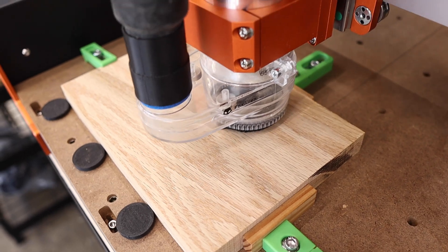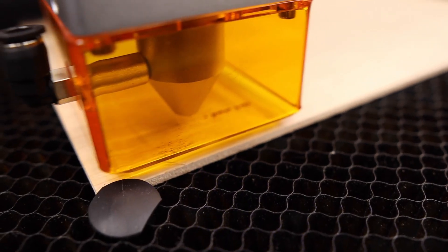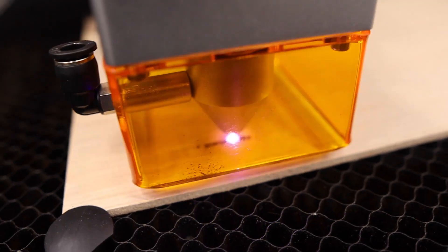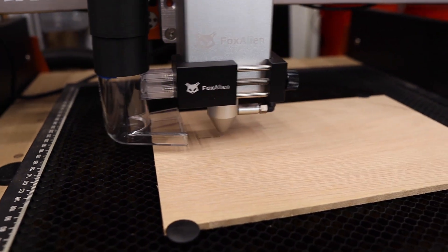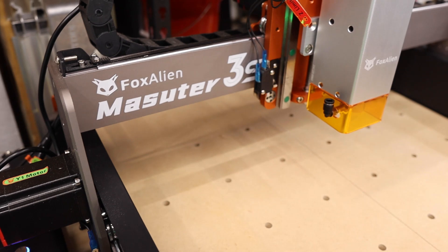There are a few things I think can be improved upon, and the first is safety. Being that this is a CNC machine first, the overall footprint is a little bigger than most 400mm by 400mm laser engravers, which is going to make it hard to find an enclosure for this. Enclosures are really important because you need to protect yourself and others from the harmful laser light and fumes produced. The included safety shield is okay, but you can't use the fume hood and the shield at the same time — they just don't fit together, so you're kind of forced to pick one or the other. Having fume extraction integrated into the safety shield would be a good idea for a future laser module. And as I said before, this isn't going to be a super fast laser engraver. Cutting is on par with other lasers in this class, but it's tough for this machine to get up to the speeds that standalone lasers can reach. But of course that's expected — look how much beefier the gantry and Z-axis carriage are on this thing. This is a CNC machine first and foremost, so these parts need to be heavy duty to stand up to the stresses of CNC routing. There's a lot of extra mass here — that's a good thing for routing, but not for laser engraving.